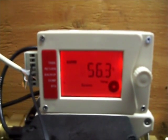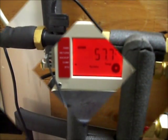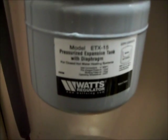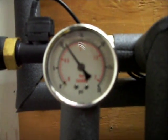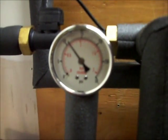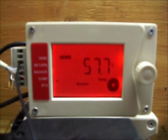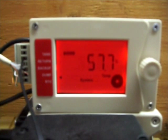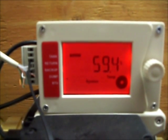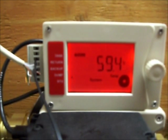We're just missing the tank. It's working really well - it's only 60 tubes out of 90 at the moment and we've just got partial sun. Here's the system pressure: we've got a 12 psi pressurized expansion tank, about just over a gallon in size, and our pressure at the moment is just over 10 pounds. We'll see how high that goes as the temperature increases. When we last looked at the temperature it was 57.7, so it's increasing fairly rapidly. It's minus 5 Celsius outside and some of the piping on the roof isn't fully insulated yet. So this is quite amazing temperature performance.